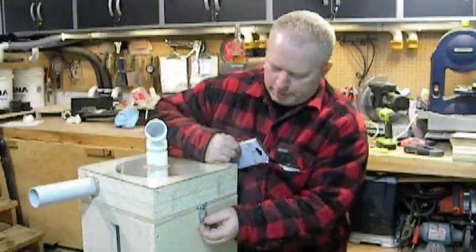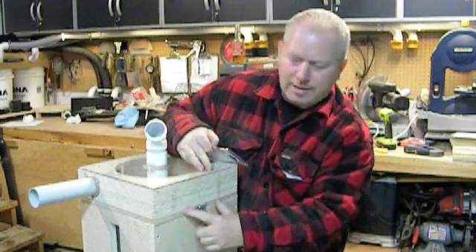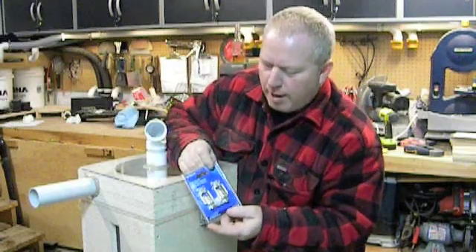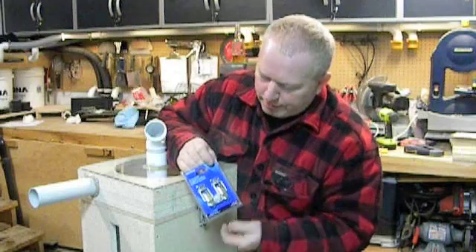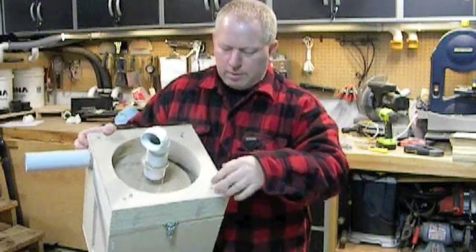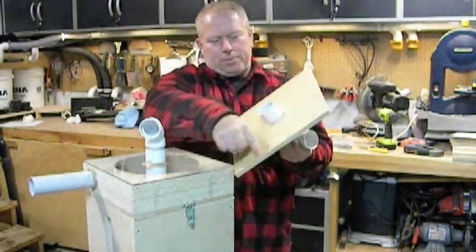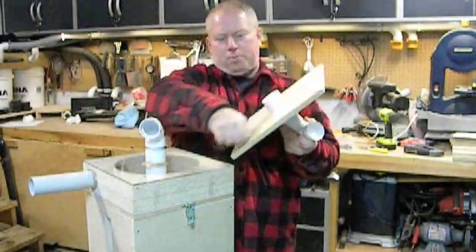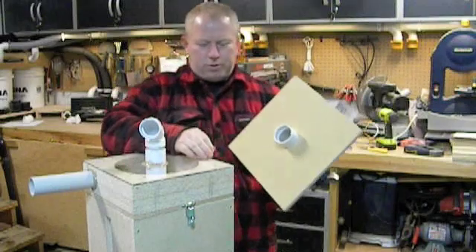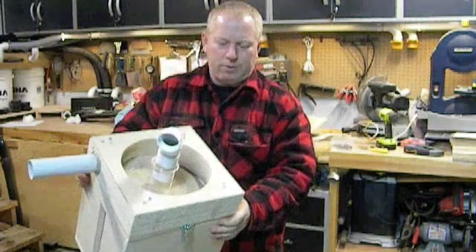What I've done now is put on these draw catches. You put them on and they just pull it down a little bit so it seats nicely — that will make sure there's no area that gets sucked in backwards into the system. These are actually called draw catches and I got these ones from Canadian Tire. On the top here, what I'll do is take some caulking and put a bead of caulking around it, then smear it off and smooth it off with a putty knife. That way it will act just like having some weather stripping. On this top one I don't want as much pressure — I want to put four screws in, so I have drilled and countersunk four screws right in here.